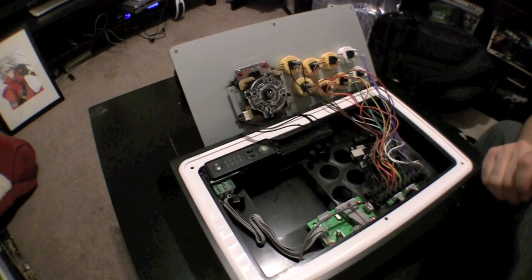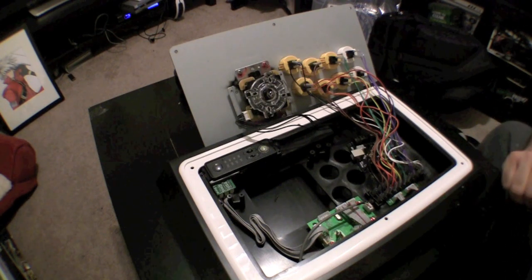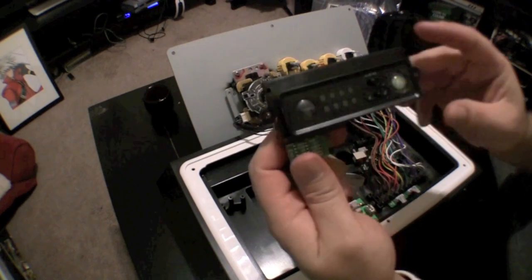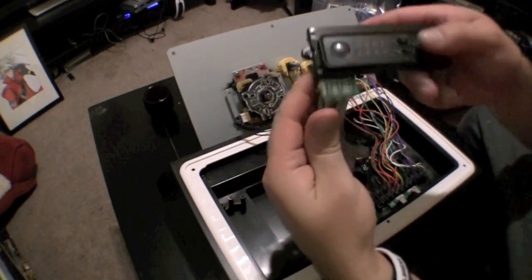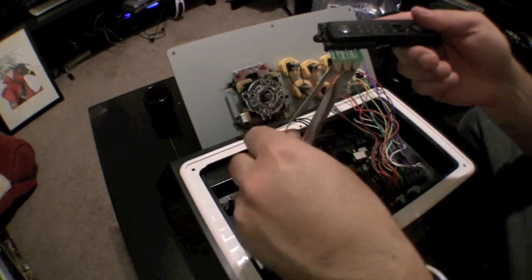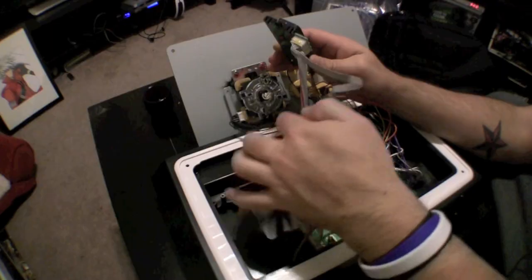After wiring your joystick to the PCB, we'll move on to the guide button and the turbo button. You're going to have to remove this piece from the fight stick. Use caution when doing so because the screws on it are really small and they can be easily stripped. Also, when removing the wires, remember where you unplugged them from.